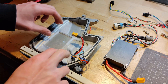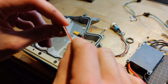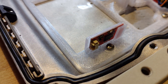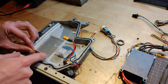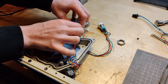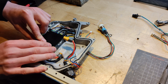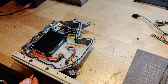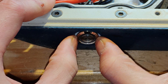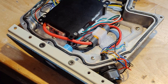After you print the flip frame, place it inside the controller housing. The holes line up with the factory standoffs and we will use the same screws to lock it in place. Disconnect the BLE module from the harness and press it into its dedicated slot. You might have the Type 2 BLE module — I will be releasing a modified frame for this specifically. Plug the harness into the BLE and insert the connector. Now drop the U-Box into the cutout — this should be a loose fit. Insert the motor connector and secure it, as well as the footpad connector with their respective nuts. Then plug the footpad harness with its grounding plug into the U-Box, followed by connecting the main power. Remember to be prepared for the tiny spark.